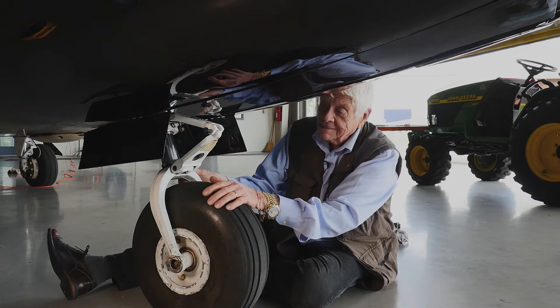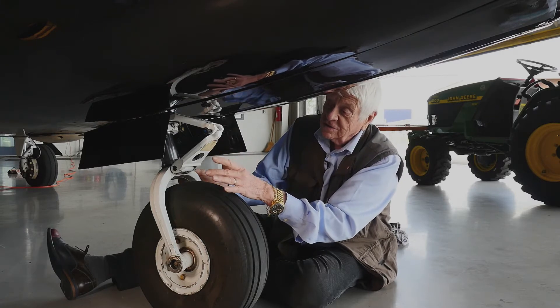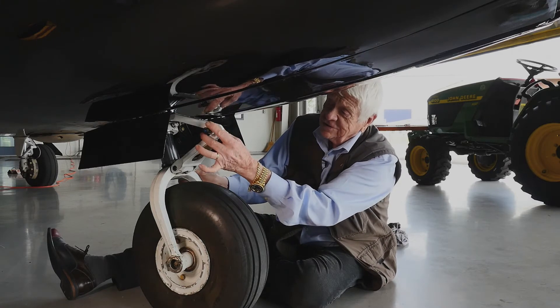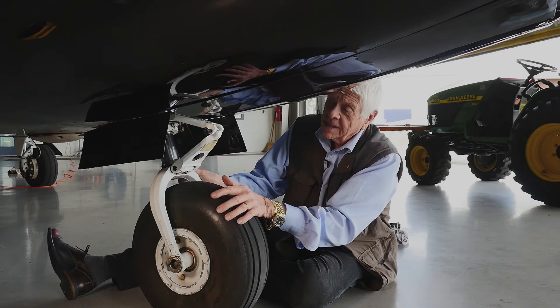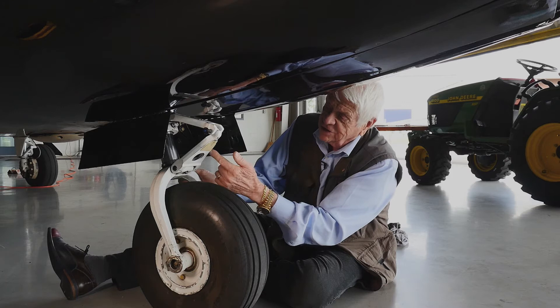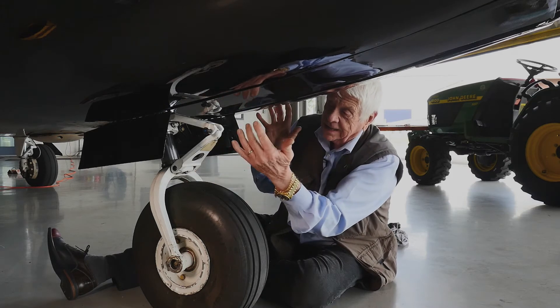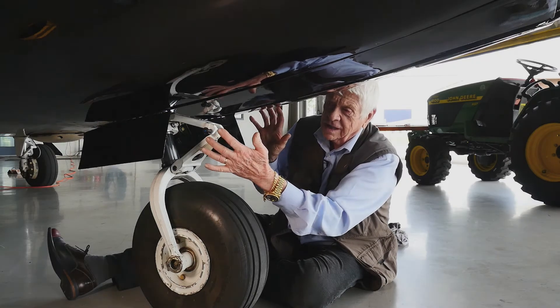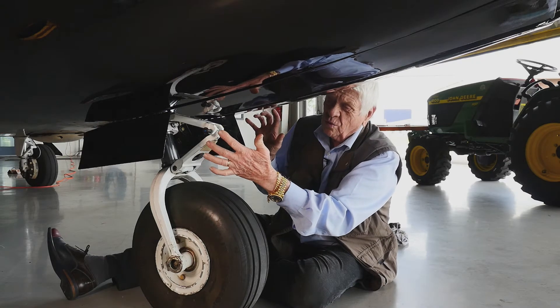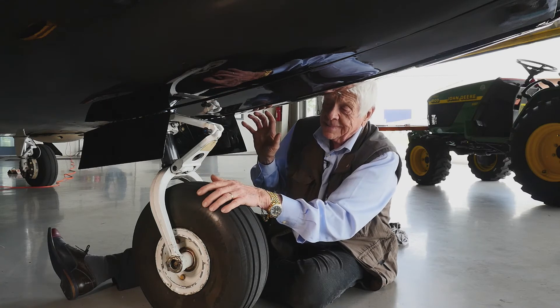The main message is to tell you how these bushings work and what they do. If these bushings get worn and you get shimmy in the nose wheel, that transmits a shock up through the nose gear assembly into the nose wheel box, and the hat section rivets start to work. Pretty soon you have one problem causing another — you don't want to go there.